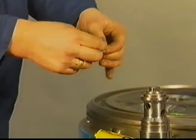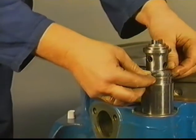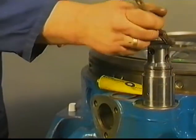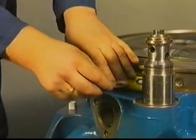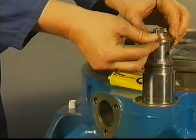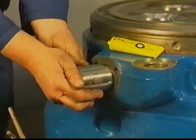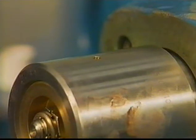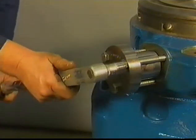Keep the piston on the valve spindle mounted for guiding during grinding. Use the prescribed torque for the self-locking spindle nut. Renew the O-ring and lubricate it with silicone grease. Use a new copper ring and keep this one in place by means of high temperature grease. Mount the valve with the venting hole downwards. Tighten the bolts to the right torque setting as mentioned in the manual.